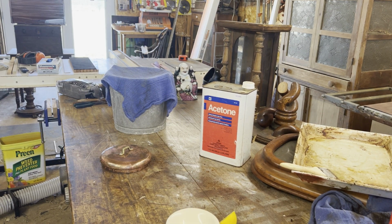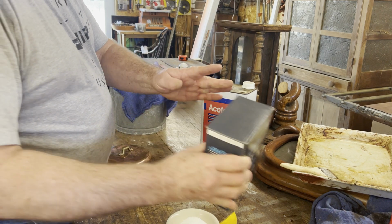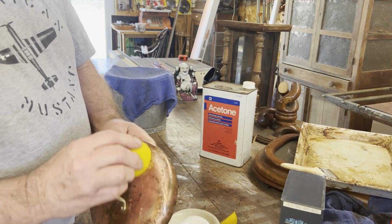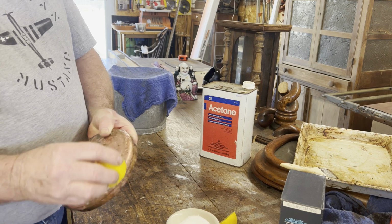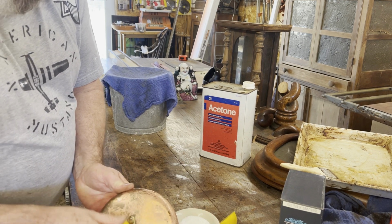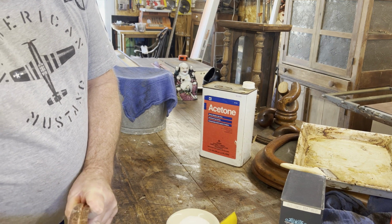I have a lot of really bad copper to polish. Two things, salt and a lemon. Doesn't make sense, but the combination of the salt and that citric acid of the lemon is just perfect to not scratch the copper, but eat off years of tarnish that was under the lacquer. If there's any lacquer left, it won't polish, so I'll know where to go back and hit it.